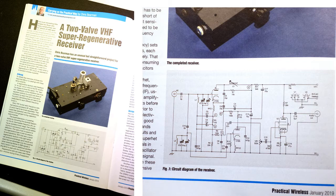The project was aimed specifically at the amateur radio market as a retro-styled project for use on the 2-meter, that's 144 MHz, amateur band. It performed well with no adjustable regeneration control, and the tuning control feel was very much akin to a multi-valve superhet. The two controls on the front panel being just a tuning control and an AF volume pot.